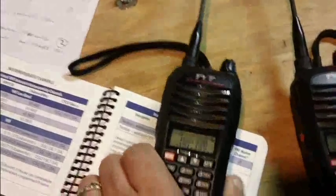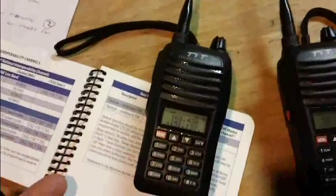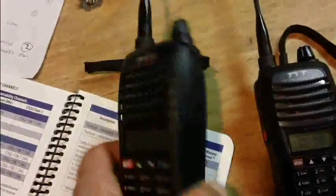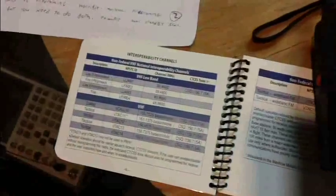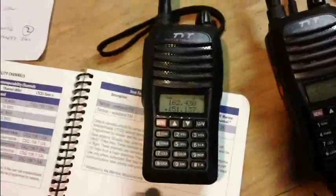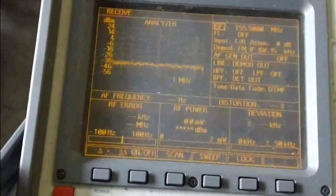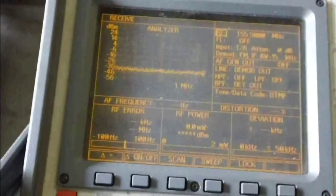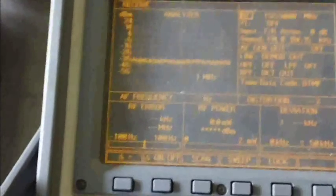This radio is capable of going down into half-channel frequency resolution. Baofeng/Cato Communications received a shipment of upgraded radios that added that particular feature — previous versions couldn't go to that resolution. That's a big plus for me because I use interoperability channels when assigned to incidents. It's very valuable for volunteers and public safety agencies. Amateurs may use narrowband on amateur frequencies as well, though I'm not certain of all the rules pertaining to that.